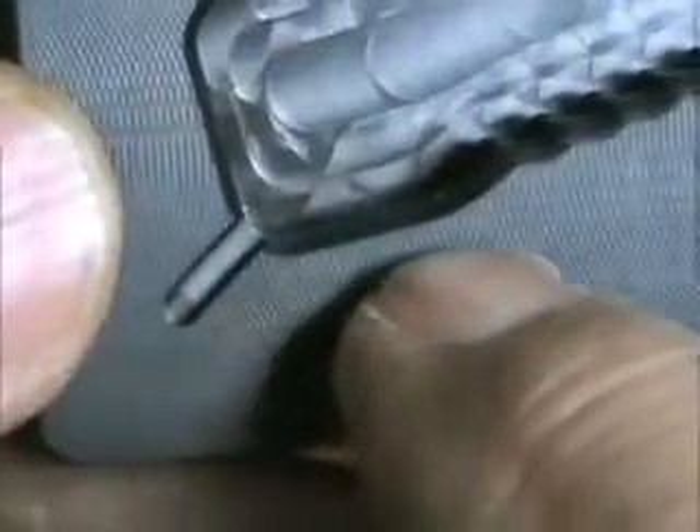When you adjust this, you want to adjust it so this portion of the tip lead-in slot is not quite to the back of the collator plate slot. That way, the tips of the bullets will absolutely always get in there and be moved out into the main portion of the slot, and the bases will have a wide ledge to slide across.